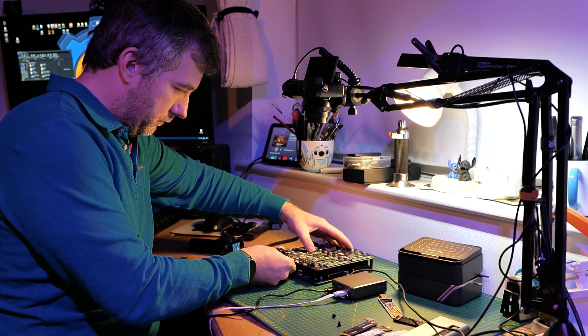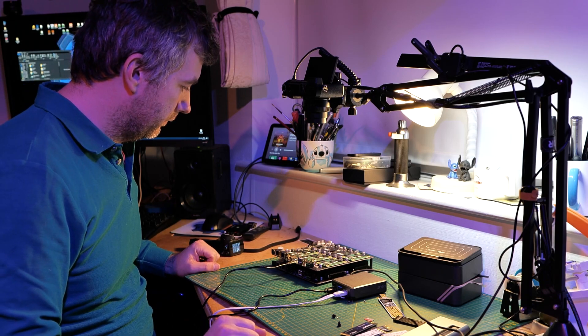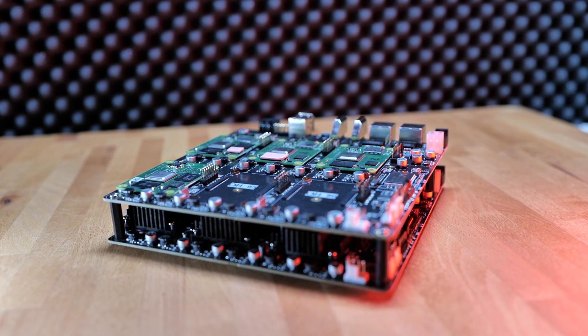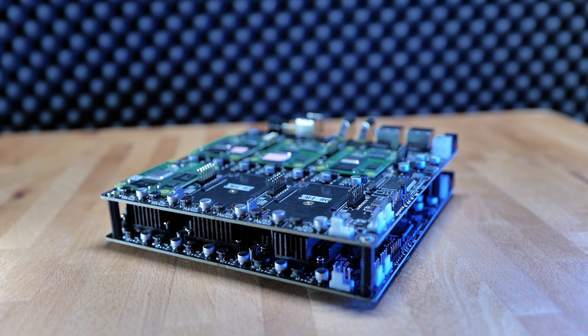It's actually a quite brilliant solution. Even though you cannot aggregate those ports to make them faster than a gigabit, there is a very good use case if you ever need — and that's a big if — a bigger cluster than six Compute Module 4 boards. This extra port allows you to daisy chain the motherboards for the ultimate cluster sandwich.